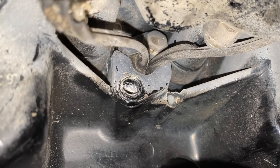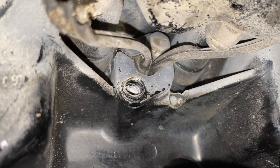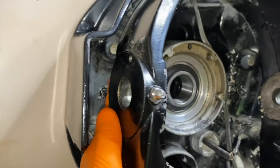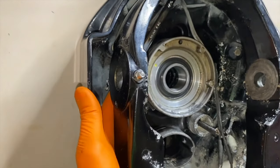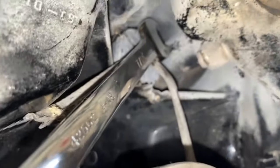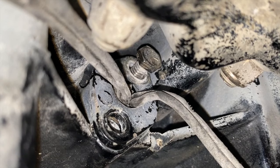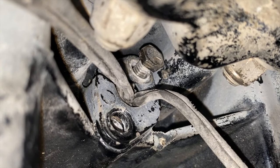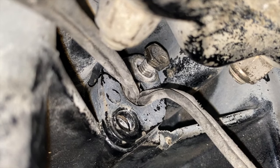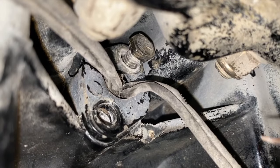As time went on, the manufacturers must have decided that adding that second bolt way up top was very inconvenient when servicing this portion of the engine and installing new wiring. We've got an Alpha 1 Gen 1, so we need to remove that upper bolt. Alpha 1 Gen 1 owners, just be patient — this is a very annoying and difficult step. I'm coming in between the transom and gimbal ring with my 7/16 wrench — really it's the only thing I can get up onto that upper bolt. Just be patient, it is not easy.